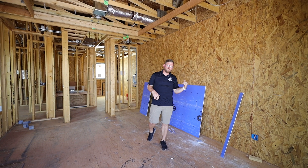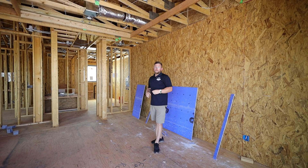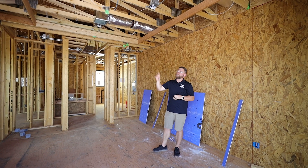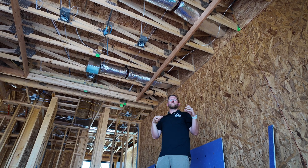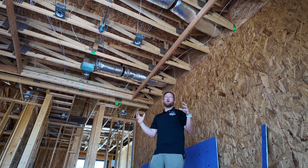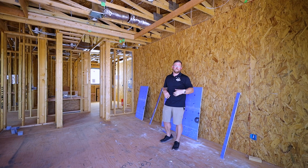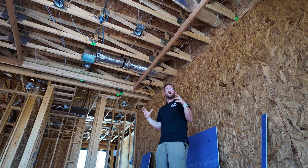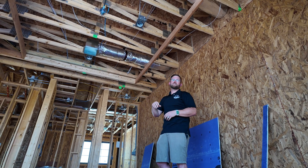Our interior designers often have a major impact on truss design, as seen in this coffered ceiling detail where the parallel cord truss has a six-inch coffer, minimizing that space to almost 18 inches. We need to ensure that in areas where we're doing this we still have enough room to get all of our systems within the attic cavity. In this location — our indoor-outdoor living situation with an outdoor terrace and fan room upstairs — it works well because we have small 8-inch ducting, so we don't have a lot of box-outs and can maintain the structural rigidity of these parallel cord trusses while minimizing the overall height of the truss.